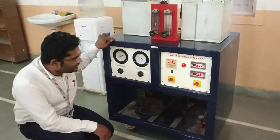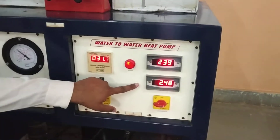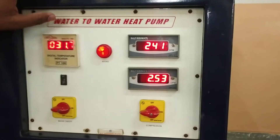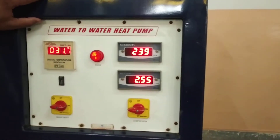In the control panel you can see the voltmeter and ammeter readings, which indicate how much power supply is given to the compressor. So we can find out V, I, and cos phi — the total power input given to the compressor.